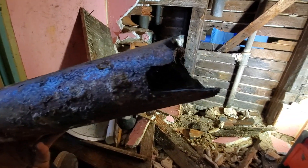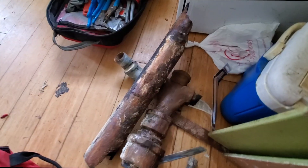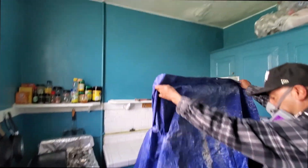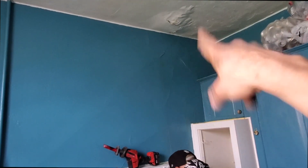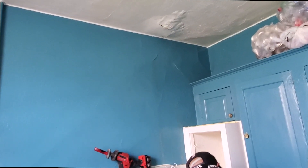This has just been leaking the whole time. This came right up from where the unit below had the leak. We're going to open up the wall, cut the 3-inch riser, and then run it through to upstairs.